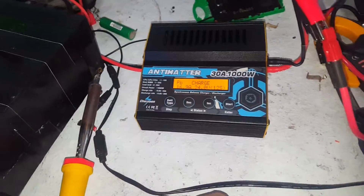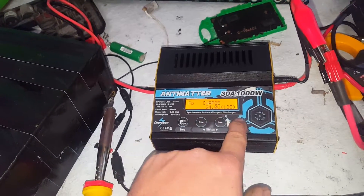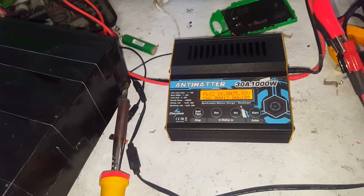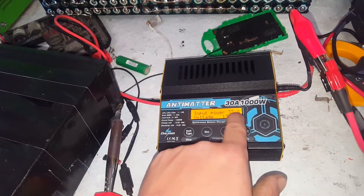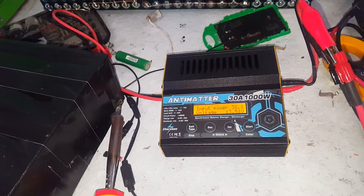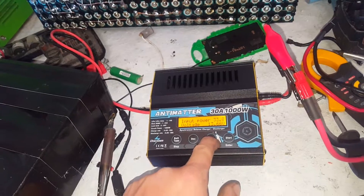66 amp hours at 24 volts is pretty awesome. You can set the discharge to whatever you want, but it will only do whatever the heatsink can handle. This charger here can handle 16 amps and is putting out 33 to 36 amps out of 13 volts — squeeze it through there and up into the batteries, though that'll drop off pretty quick with lead acids.